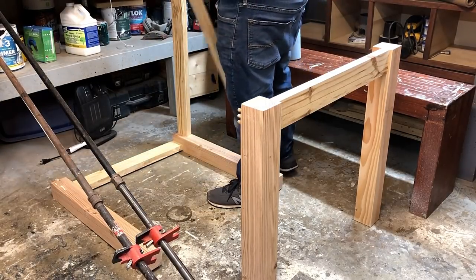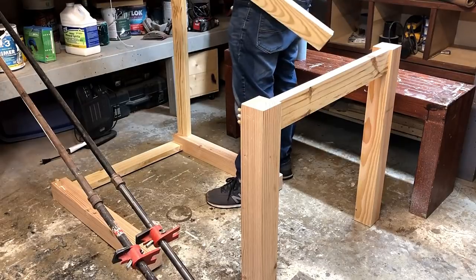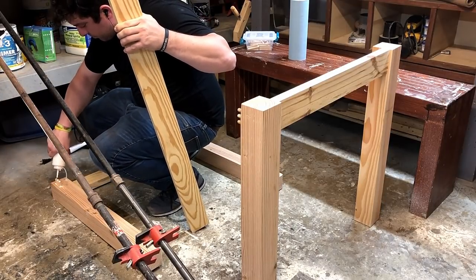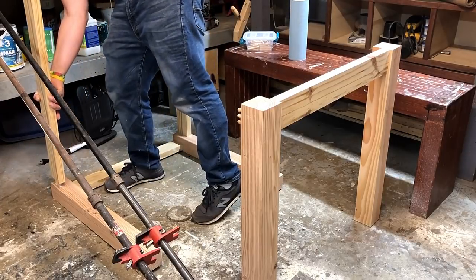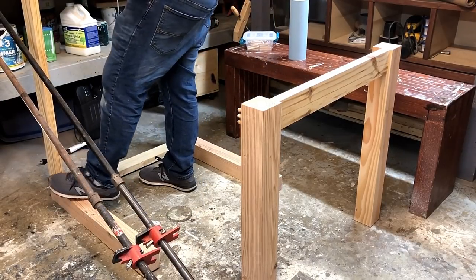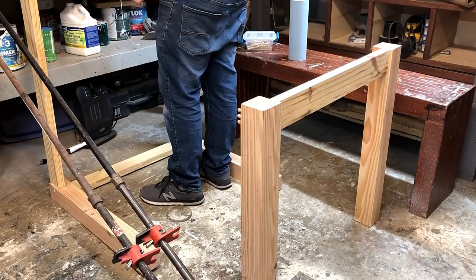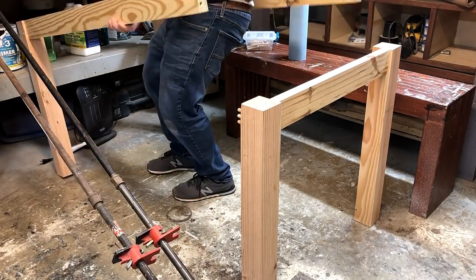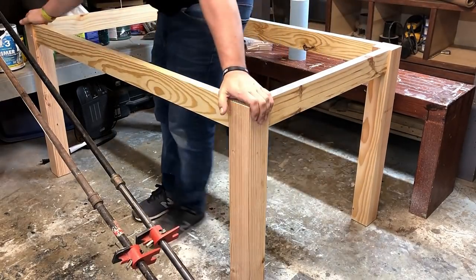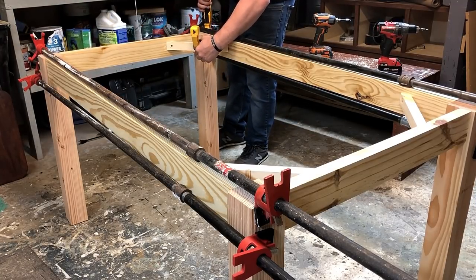Dowel joinery I think is a pretty good form of joinery. With the fact that I pin the corners, which you'll see here shortly, it's not going to pull apart ever. You see a lot of older furniture that's dowel joinery that's come apart, and that makes people think dowels are kind of weak. But a lot of that stuff is factory made and they probably didn't put enough glue on there and definitely didn't have the corners pinned. I do quite a few tables, and I may eventually get the Festool Domino, but doing mortise and tenon for every single joint isn't feasible for me. I did pocket holes on one table and those tended to pull out kind of easy for this application — they're still good for lots of other stuff, but they didn't work that great here.